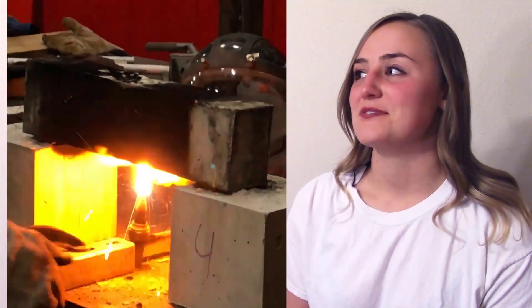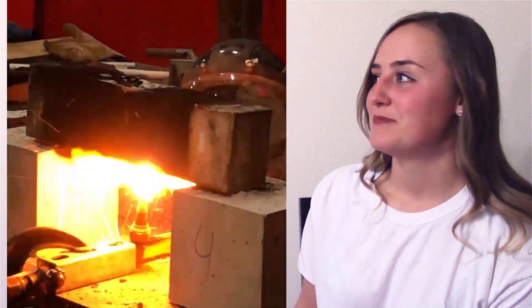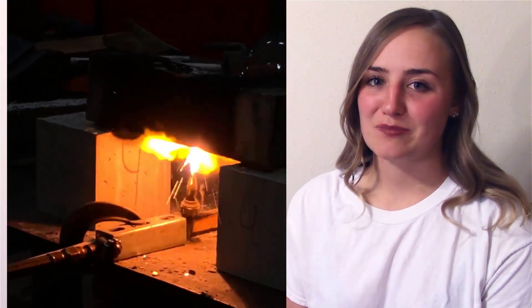Before I start talking about our actual test method I'm going to show you a quick video of what spalling looks like, because if you haven't seen my professor's video or my other team members' video about spalling, you just won't believe it until you see it. This is what happens when you put concrete into fire — immediately all the moisture starts building up and it breaks off the surface. This is why de-bonding can be such a major problem, because all the concrete cover is gone and there's nothing there to protect the rebar anymore.